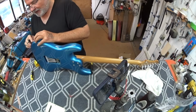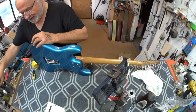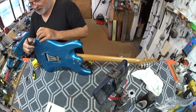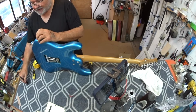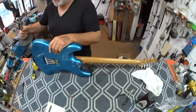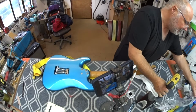Right, this way round, and this way round it won't line up. So I'm going to have to make new holes in here. The other ones are covered, which is okay. But we're not going to get this to go on. So hold fire as I mark up where they're going to go. Right, so they're just about 2.5 mils to the side. But we're going to have to do it because that's the best it's going to be. See those little extra holes there? That's the amount across that we have to go to make this work. So what you thought was a quick job with the soldering iron now becomes a job with a drill.